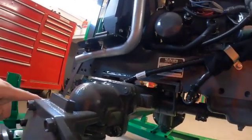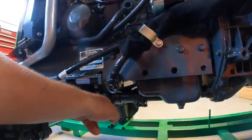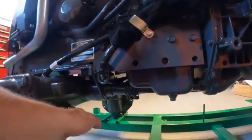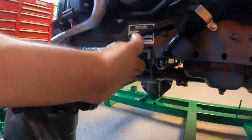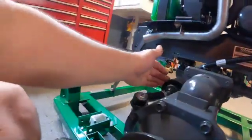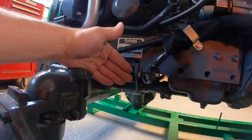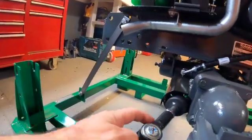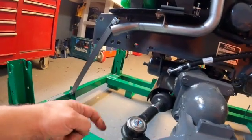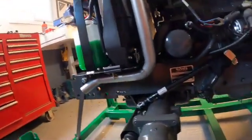The advantage to having it in the front is that Kubota, because I'm not Kubota, actually runs their drive shaft here, right in line. That actually helps out with my ground clearance. If I had a double rod cylinder here in the back, I'd have to run this guy lower, or I would have to run two cylinders, one on each side, which works good, it's fine. Many machines use it that way. But this is a simpler way, and if you're a driver worth your salt, you shouldn't be hitting things, although life does tend to happen. You shouldn't be hitting stuff with your front cylinder.